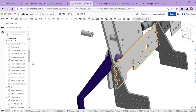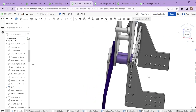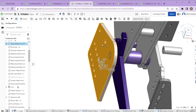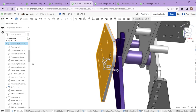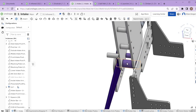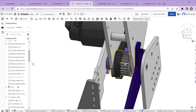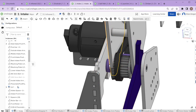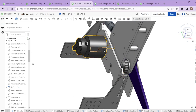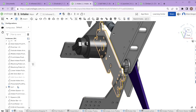Another way teams can do this is with an aluminum plate that's a little stronger and more rigid — the intake could just pivot off that plate with nothing on the other side. That works especially for a single polycarbonate plate. When you have three plates like we do with the pulley in there, it gets harder with that joint. But our approach definitely did work, allowing us to have the motor mounting and everything in there.